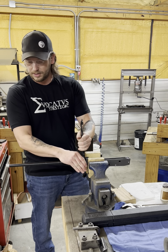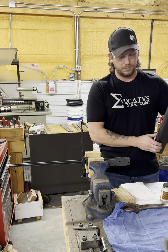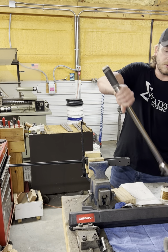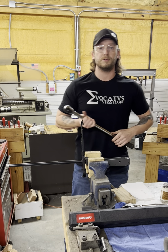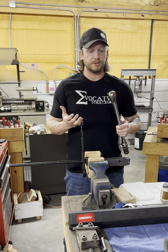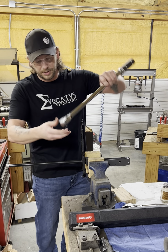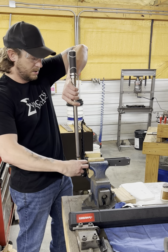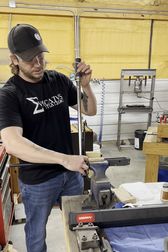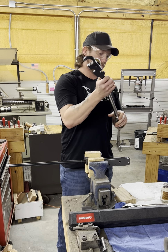We can do this kind of by hand. I've heard some people say 120 foot-pounds, but we tend to do 130 to 150 foot-pounds. We keep ours started at 130 foot-pounds. So we place our torque wrench into our AR armorer's wrench.